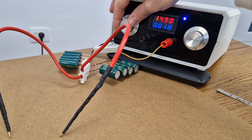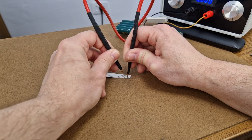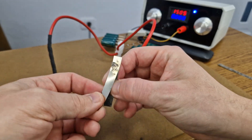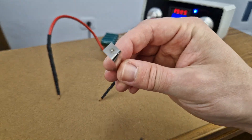I will increase the voltage to 15V. Let's try to weld together two nickel strips of 0.15mm. Hey, looks like the nickel strips are... almost welded together.